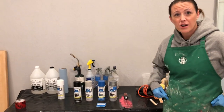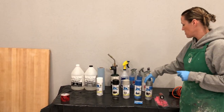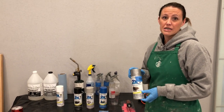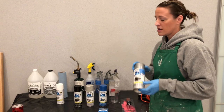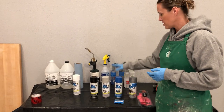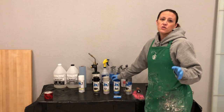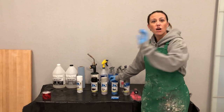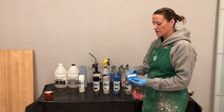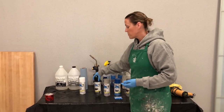I'm gearing up because this is a messy process and I'm extra messy. Today we're really excited — this is one of our favorite colors, the Rust-Oleum 2X Metallic Aluminum. It does some really cool and crazy things when you mix it into the epoxy with different colors and spray some alcohol on it. The customer is a law enforcement officer and these are the colors they requested — this brilliant blue — it's going to look very cool in their kitchen. They're remodeling with gray countertops and a diamond-plated backsplash, which is where the aluminum comes in. We're mixing brilliant blue with Stone Coat Countertops metallic powder in crater-lake blue, satin stone gray, and some black.